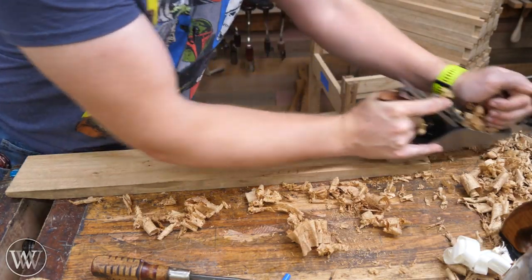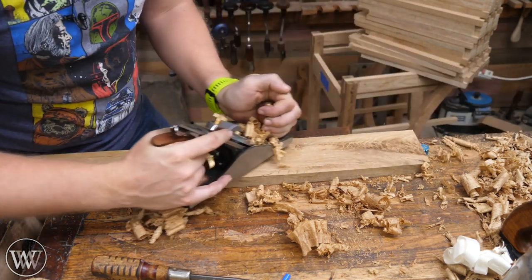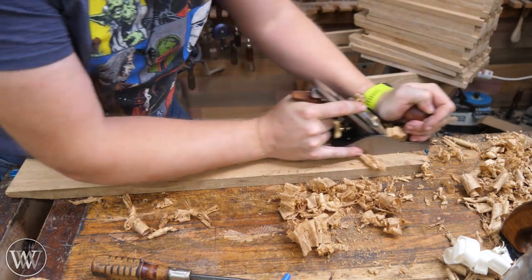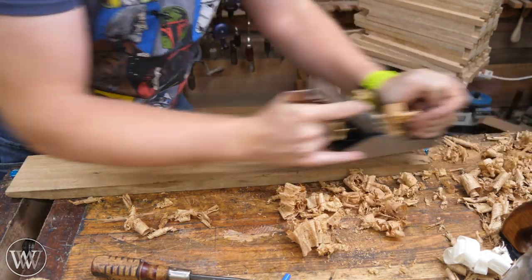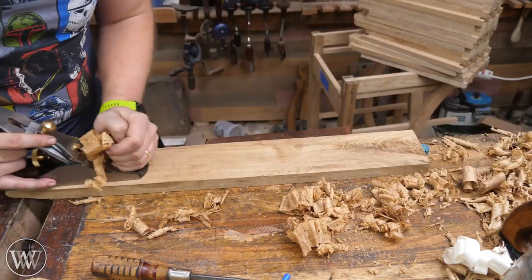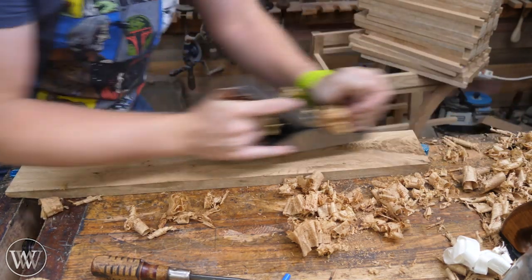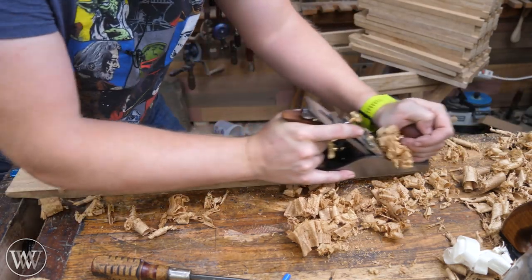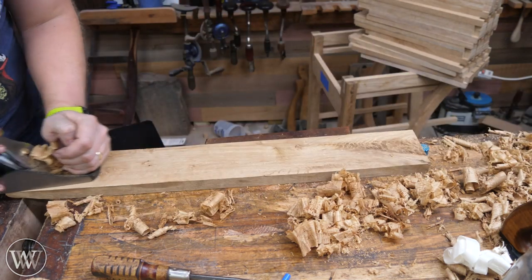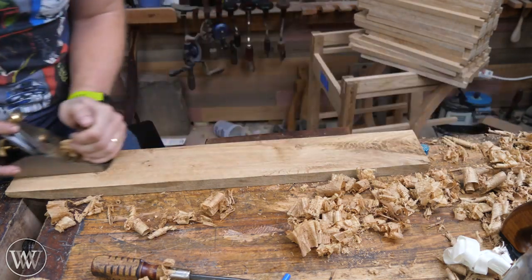When smoothing and doing all the detail work, you want to make sure you're going straight in line with the board — your plane parallel with the board. You don't want to skew it, because that actually lowers the angle of attack and makes the mouth effectively bigger, increases the distance from the chip breaker, and raises the chance of tear out. Skewing the plane is a great way to make planing easier when you're taking off large amounts, but for smoothing you don't want to skew. Go nice and straight all the way along the board, and that's what gives you these beautiful curls. I love how smooth this is coming out — I have to be careful that I don't plane the board into non-existence because it's just so gorgeous.